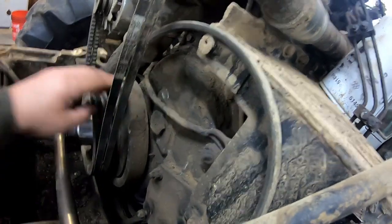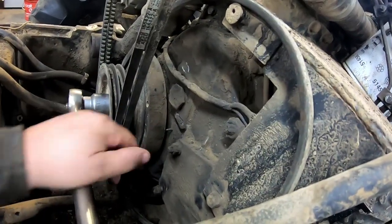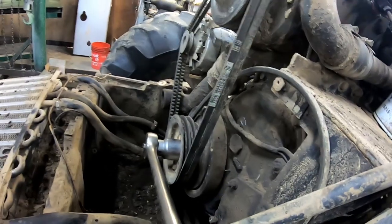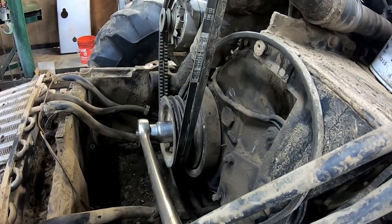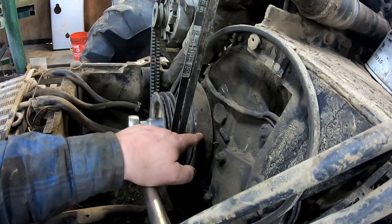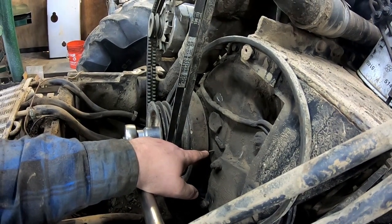when I put the inner coupler on, I make sure that the timing mark is lined up with the pin here. And then finding the outer coupler, that can change depending on whether you're an over, under, clutch spinning, all that good stuff. But as a bigger hole, it's on the outside, it's easier to find. The inner one can be a bear. And so once I find the outer one, I just crank the engine backwards, and that way the overrunning clutch and the underdrive just lets it freewheel.